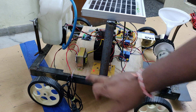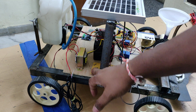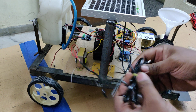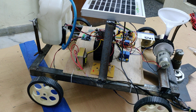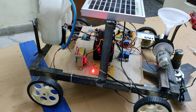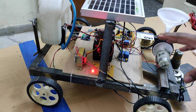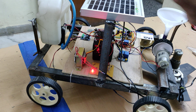We can see that due to the tube light intensity indoors, we are getting low voltage from the solar panel — that's why the intensity is very low. When you want to charge the battery from the transformer, connect the T connector at the T or S slots and power on the transformer. The transformer will step down the AC voltage to 12 volts AC, which is then converted to DC via the charging circuit. The battery will get fully charged in a maximum of eight hours, either from the transformer or solar panel.